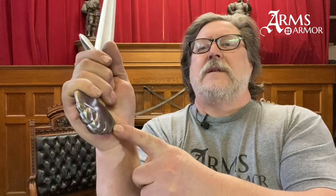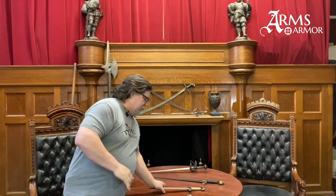One thing I like to make sure people are aware of in the discussion is that the materials involved also affect how easy or difficult it might be to adjust. They may well have been done by the maker of the sword — some of the pommels seem to be designed that way, so that the tang passing through the pommel and being peened has a slightly tilted tang hole through the pommel in the right direction to accomplish that. But when you look at how these swords were used, a lot of the pressure is pushing right at the base of the hand against that pommel, and depending on how sturdy or heavy your tang is, that may have something to do with it.